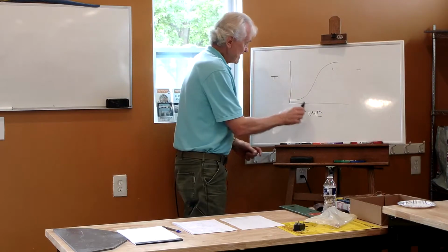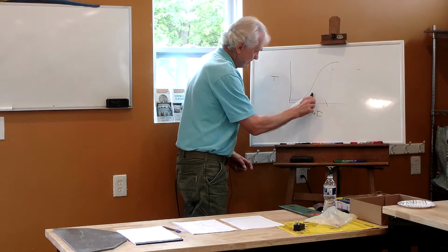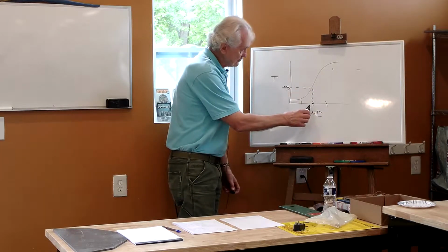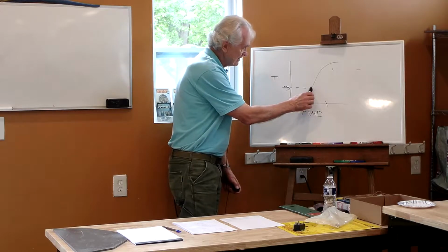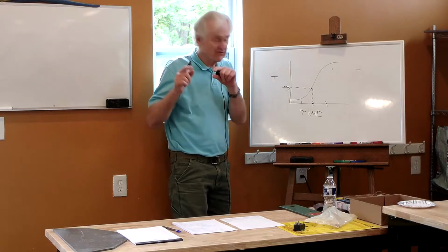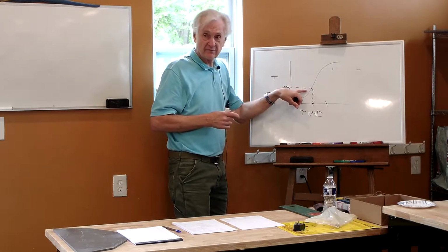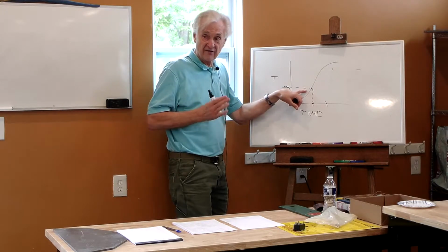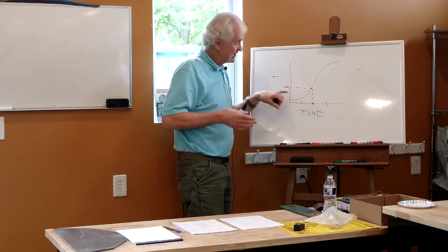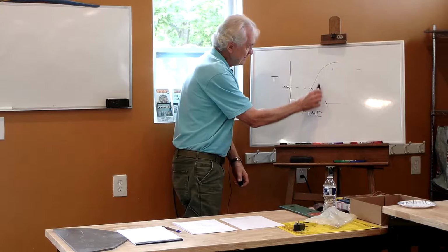And so they know that after 2 hours, I should be at that temperature. And so after 2 hours, the temperature that is recorded and goes to the controller, it compares that to this sort of list that it has. And it says, well, am I higher or lower or right on that temperature? If I'm higher than the temperature, it turns off the heat because I've overshot. If I'm lower than the temperature, it puts a little more heat into the elements. And if I'm right on, it just keeps on going. So it's constantly checking what time, what temperature am I?